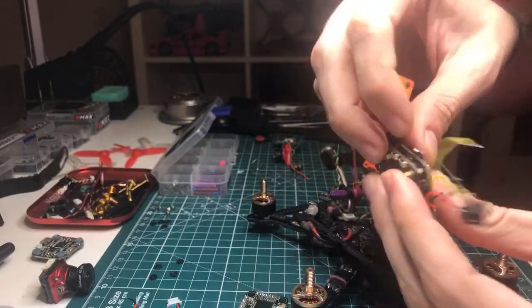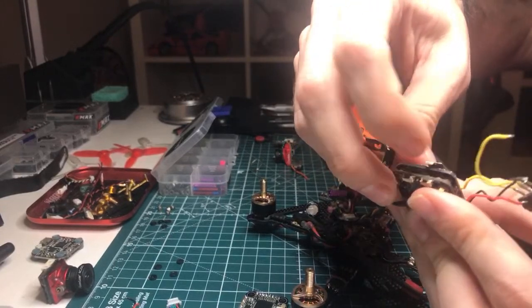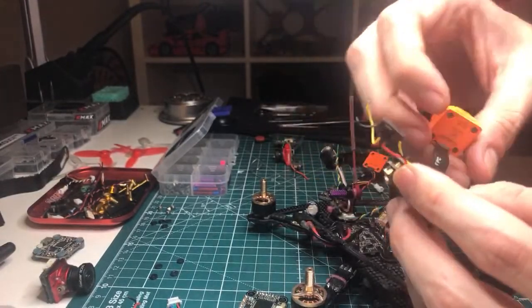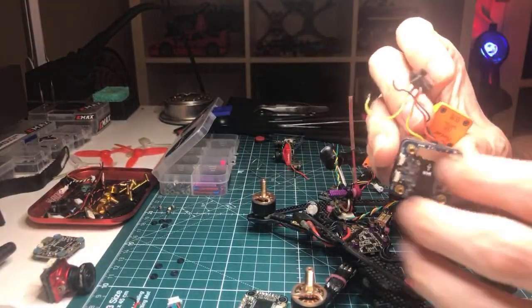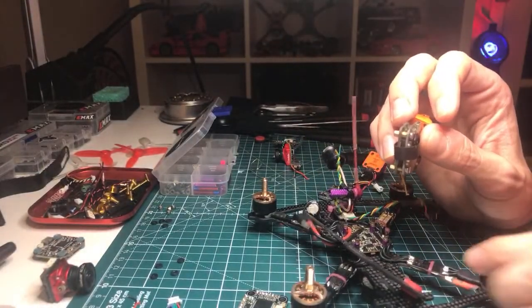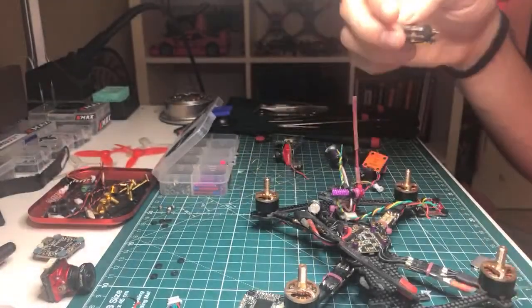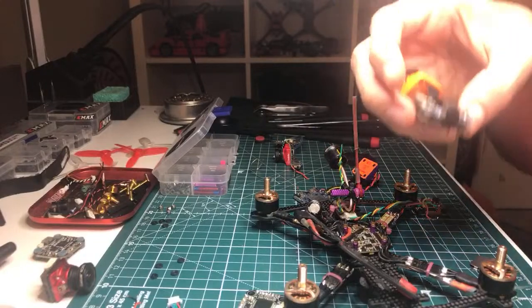So when you get home, you don't have to screw around with removing the memory card to get the footage off. You just plug into it with a mini or micro B or whatever, the USB cords that we all have 10,000 of, to get the footage off, which I really do like, but I am slimming this build down as much as I possibly can. These motors are kind of big. I don't necessarily like how tall of a stator they are, so they're a little bit too heavy, so I'm going to try to offset that by running the single board RunCam Split on this guy.